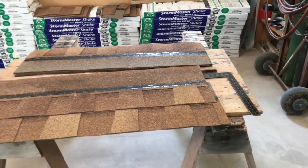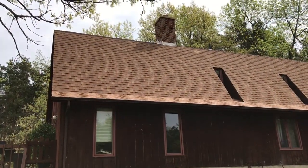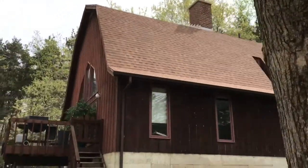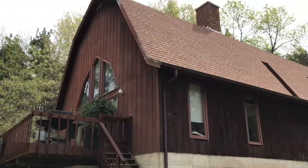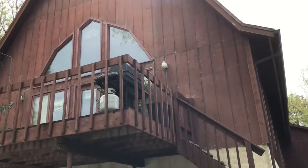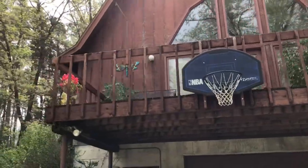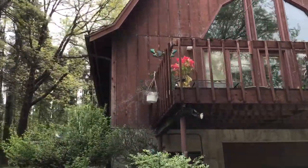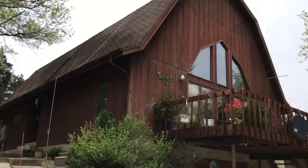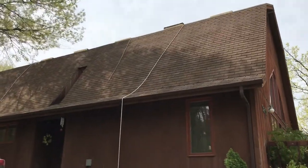When I get off that roof for the last time, I don't plan to ever go back on it at my age. This side of the roof is about 20 years old now and has suffered a bit from algae growth because it faces north and east and is more heavily shaded. These are three-tab shingles and typically you get about 20 years out of those, which is exactly what I've gotten.